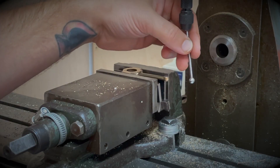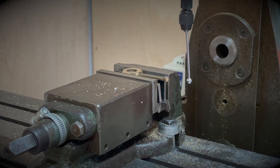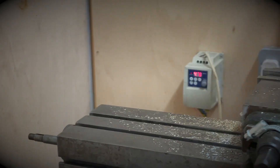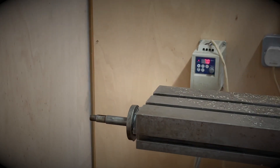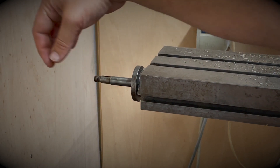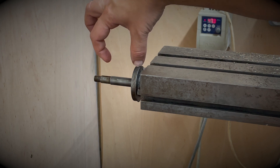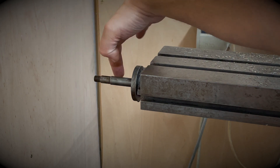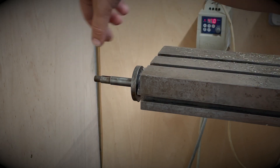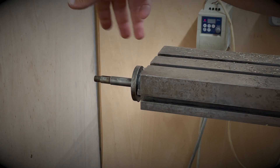What I'm trying to do here is indicate in on the center of this boss, but I'm having trouble. If I move you around, you'll see where the handle should be on this side of the mill. There's a big hand wheel that goes on here and inside there's a resettable micrometer dial, and that resettable dial is just drifting and I can't lock it, which means as I try and turn this, the dial just kind of spins loosely and I've got no way of knowing how far I've moved.